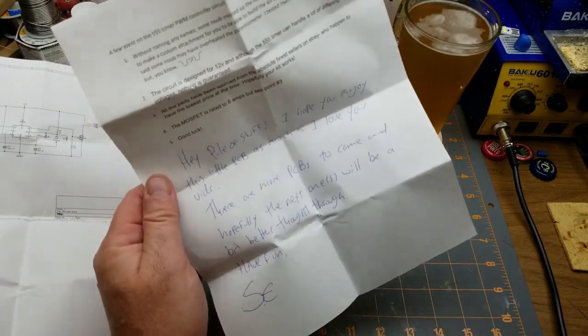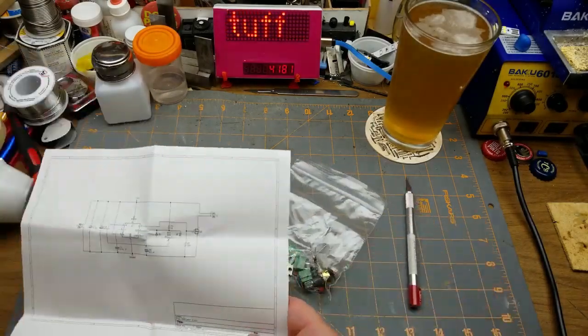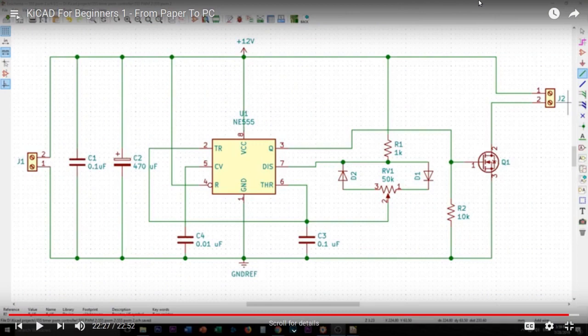The circuit is designed for 12 volts, with MOSFETs rated for six amps. There's a personalized note too. Here's a freeze frame of the schematic from his video — it's a fairly standard 555 circuit. These two diodes with their 0.6V voltage drop, and wherever this thing is set between the charge and discharge cycle, adjusts the threshold and causes the PWM to happen. I'm going from memory so I may be a little off, but he goes through it in detail in his playlist.